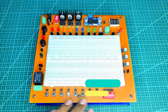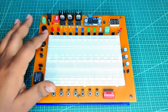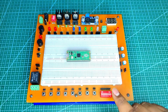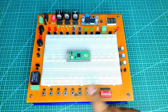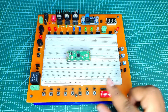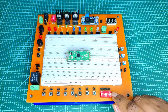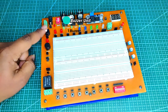I have also placed push buttons on board because when placing more than 3 to 4 push buttons on a breadboard the wiring gets messy. I also used an 8-bit DIP switch — since we have 8 on-board push buttons, I used an 8-bit DIP switch which is very small in size compared to normal on/off switches and takes less space. The first pins of the switches are connected to 5V DC supply, making them flexible to use with microcontrollers as input switches.